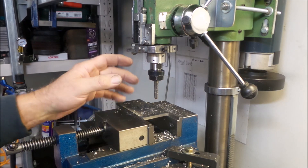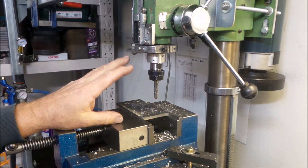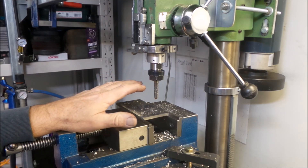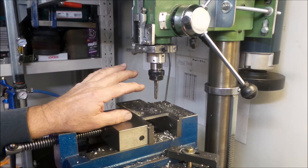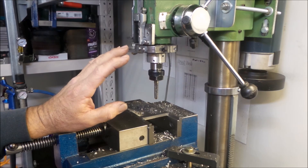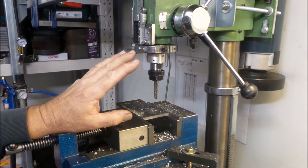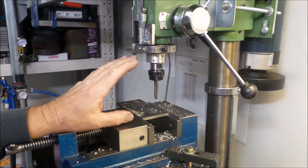Realistically, the biggest I've probably tapped in here is a 12mm tap in mild steel — it seems to cope with that okay. Smaller taps, absolutely no problem. The only thing you've got to watch out for is being very careful you don't start binding in your material and snap the taps. I have snapped a few taps when I've been a little bit exuberant, but I've got it pretty much sussed out now. With about 60 of these holes to do, having a machine in your home workshop that can do that is just a total godsend.